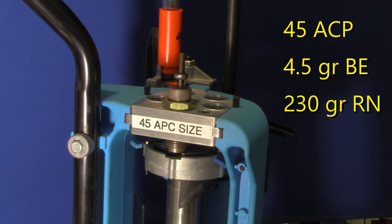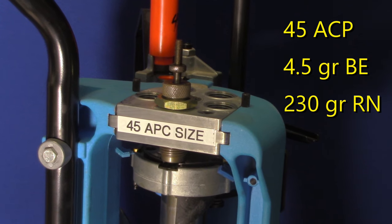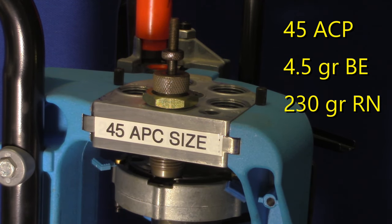This press, for example, is calibrated to reload full power 45 rounds using 4.3 to 4.5 grains of Bullseye, standard large pistol primers, and 230 grain round nose lead bullets. Before your first reloading session, it is worthwhile being scientifically skeptical and confirming absolutely that each and every setting is correct. Whether you've bought a progressive reloader or a single stage press, every step I describe should be done to confirm that the settings are as advertised. As we confirm the settings, this will also allow us to review the parts and how they function — you'll get to know your reloader much better.